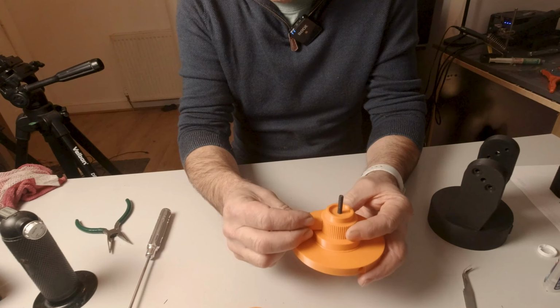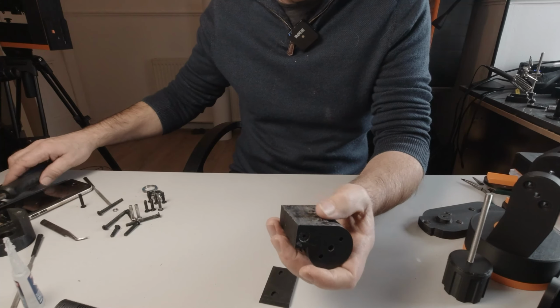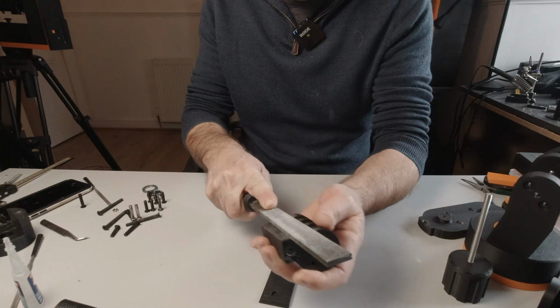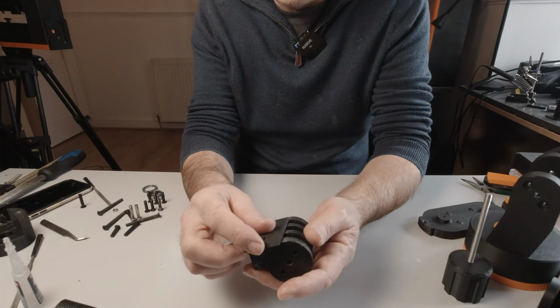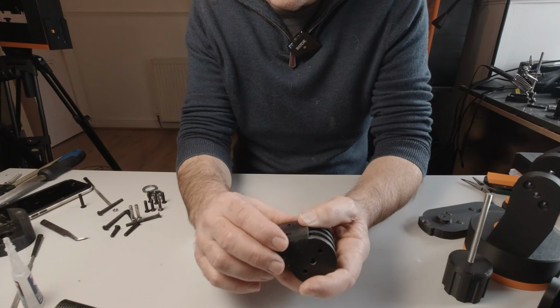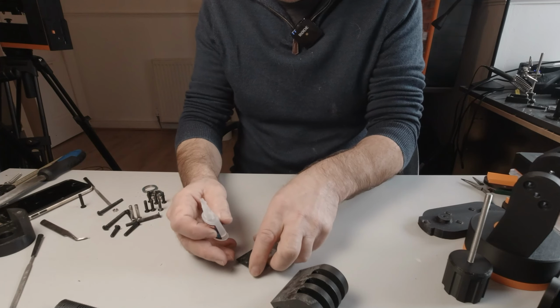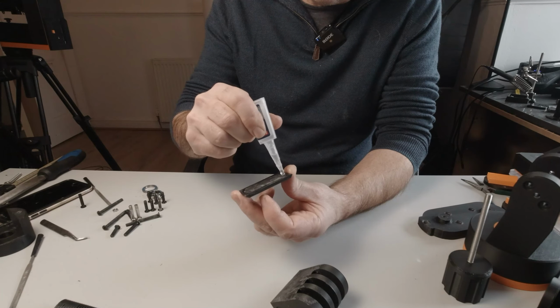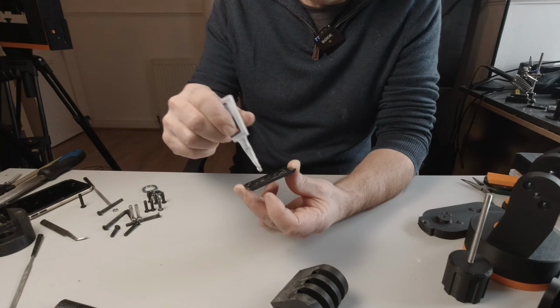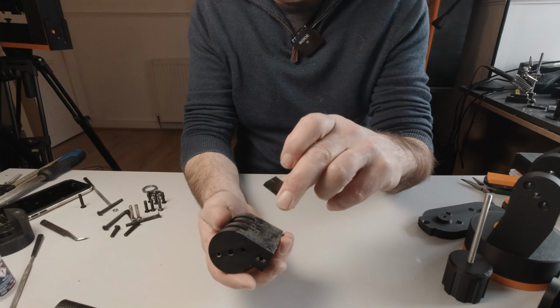So okay, before you try and glue this piece on and it goes on this way, you notice it's chamfered on three sides. The chamfer goes away from the curves. The flat side here is up beside the hinge joint, if you like. Okay, so that gets super glued onto there like that. Now before you do that, it is wise to take a file and file down across that back face there, just to get rid of any inconsistencies between the parts and to give you a nice surface to actually glue to. Okay, got this wrong the first time, and so now we can just add some super glue to the back of this plate, like so, and glue it onto the back of here.